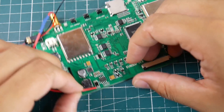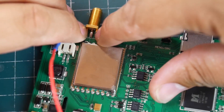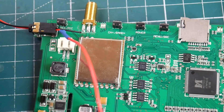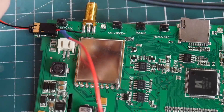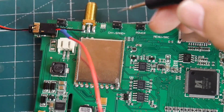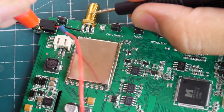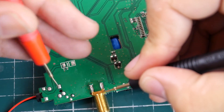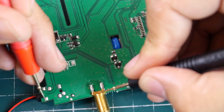So let's set this up. That seems to be in place, which is really nice — now we have 5 volts ready. Next step is ground. We can take ground from anywhere we'd like. We could take it from one of these side ones here, or from this pad. To know which one is ground, get your multimeter, put it in continuity mode — the beep mode. When you touch the two probes together they beep. This is ground, and the shielding is always ground. So now you can touch this and then touch the pins on the AV-in to figure out which one's ground.